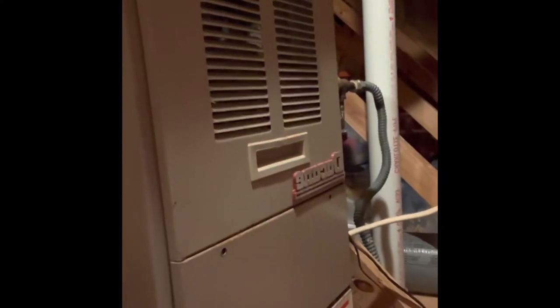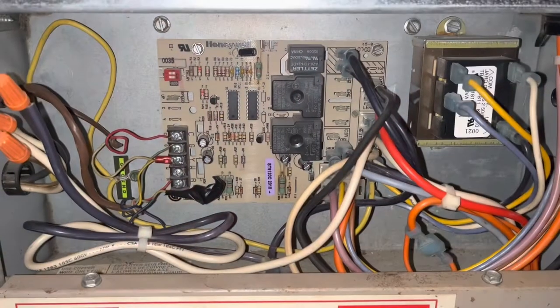Here I am up in the attic — gotta keep it running, and that even means the house's air conditioner. Today I'm going to try to replace the circuit board, which is the blower control board inside my air conditioner. It kind of has some problems. I think last year when I replaced the blower motor, some condensation dripped on the circuit board and now it's acting funny. Things like the heat was wanting to come on when the air was on, and in the wintertime when the heat was on and would shut off, the blower would keep running. So we're going to replace the digital circuit board and see how it goes.